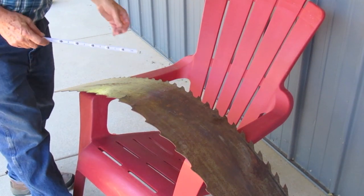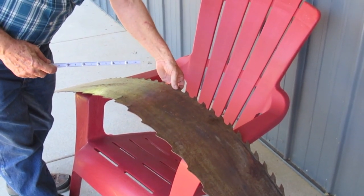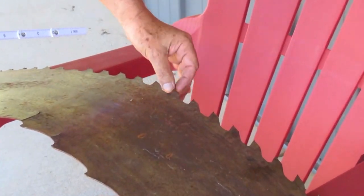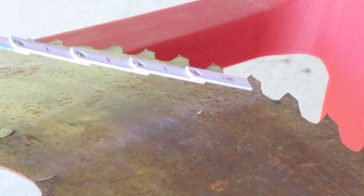In this particular situation, this is the sawing side. If you look at these teeth, they're swaged — they're flattened out — which allows a wider cut than the actual blade, so there's a wider kerf. That means less binding than the width of the blade.